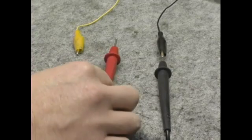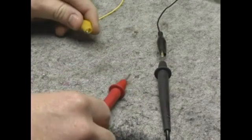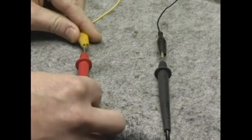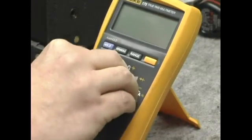We're now going to hook up the voltmeter to the center pin and the pin on the left with the yellow wire. This is going to give us the bias reading for the tube on the left. Make sure to set your voltmeter to millivolts.